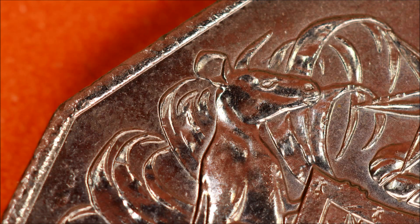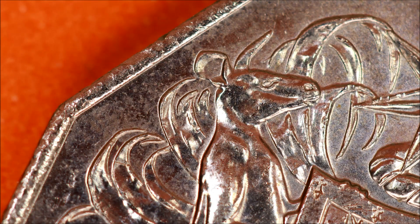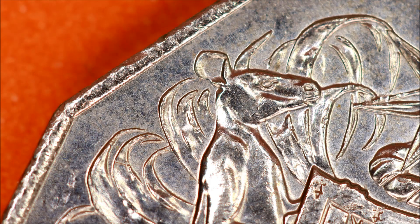If I put my hand over to create a shadow, you can see it's just a finger straight up — there are no defining marks. On the other one you'll see it's all missing. That's die fill. If it were die wear, everything would get bigger as the die wears down — the edges enlarge, the metal has less area to go into, so metal starts coming out onto the fields and everything levels up. That's die wear. Die fill means missing and thin design.